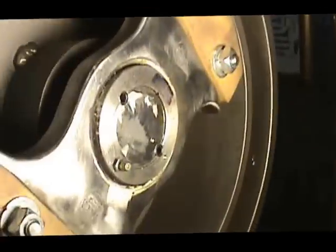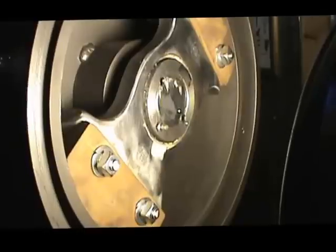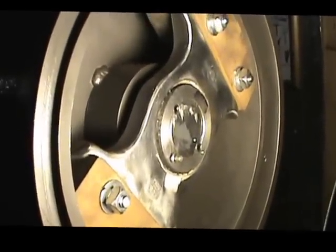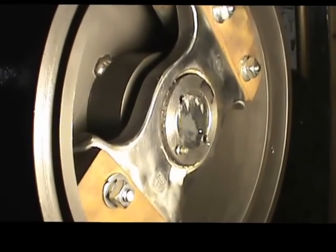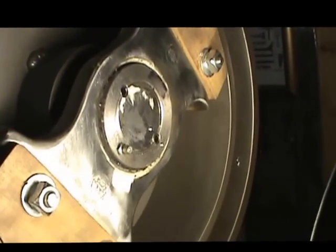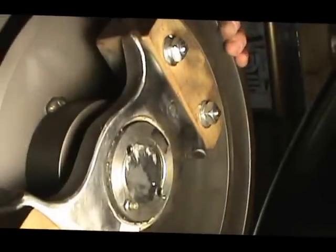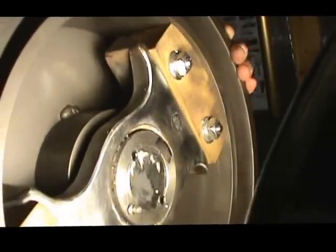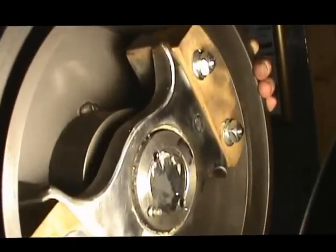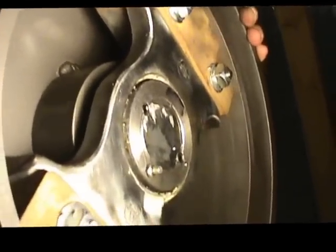Alright, I'm going to show you how this clutch all works. See, the wooden blocks are on there. Now Byron's going to push down the treadle. See how that comes forward? Do it again, Byron. She's sticking a little bit because you've got no lube on it. There we go. See how I was pushing forward against the wooden blocks? That grabs that wooden block, causing that main shaft to spin. We'll do a little better clip here in a second to show you how that's really working.